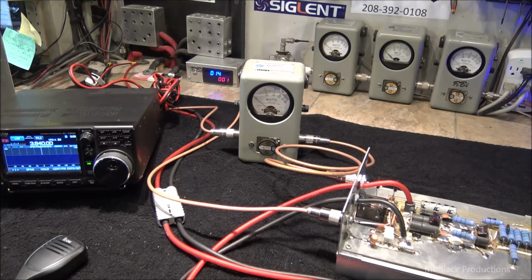As we go across the frequency response of this amplifier, the circuitry is going to represent to us slightly different points of resonance. The way they set the circuitry up inside the Worthmore is that it has pretty much a flat response across the entire spectrum, just like what we were looking at on the grid dip. We might stumble across a couple where this thing puts out a little bit more, a little bit less. It depends on what the transistor is seeing in the circuitry.